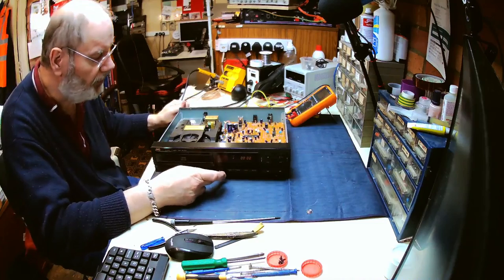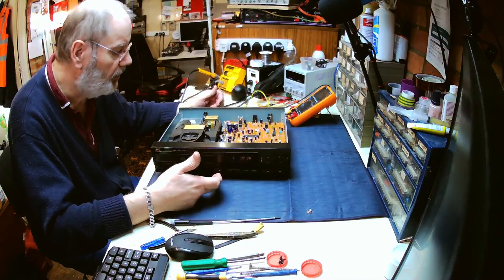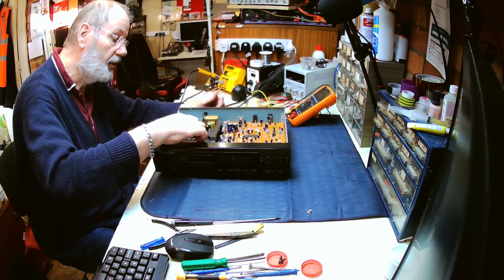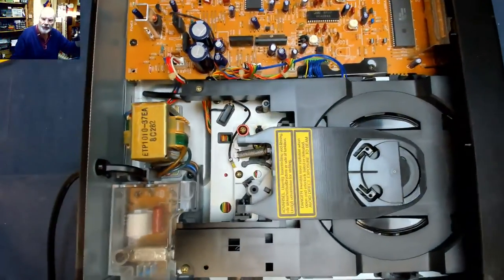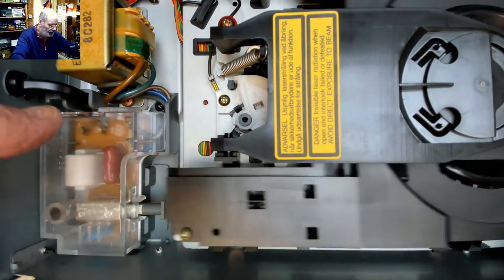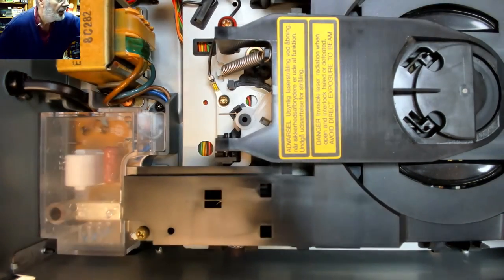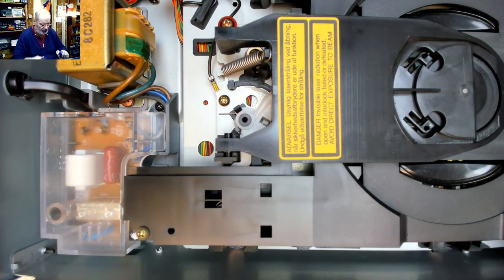So don't think it's dry, it's a belt. I think it's mainly possibly just a bit of lack of lubrication on there, where the lubricant is. Let's bring that camera into play. So you've got a lever that when you press, see that white lever moves, albeit very stiffly. I think we could get away with a quick bit of lubrication on that. The old molly coat comes in again.